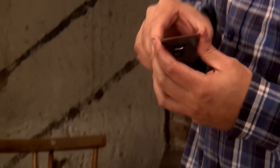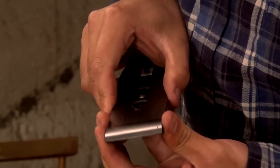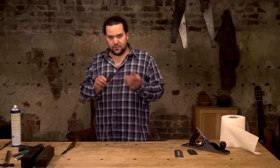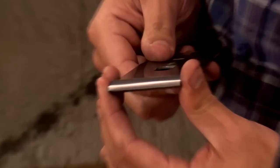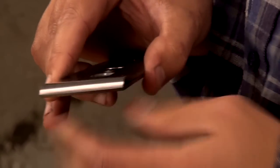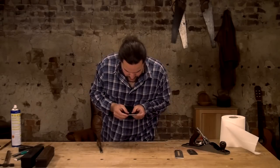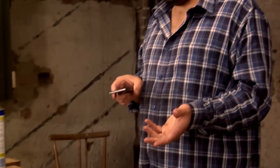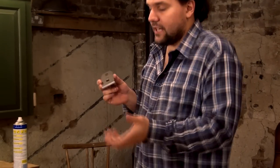What I tend to find optimises cambered irons — this camber here is about a sixteenth in the middle to nothing at either edge, so that's quite a useful size. In order to set that up, all I'm going to do is nip it down and ensure that on each of the edges it's flush with the cap iron, and then it has set itself. That's all you need to do on a cambered iron, and it will work. Because this is now optimised for the maximum thickness shaving it can take, across the full width of shaving — that's really what your plane should be doing. You don't want to be taking a skinny little thing out in the middle; it's a bit pointless.